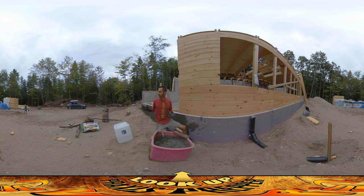What I've done so far is mix it in half-bag batches. For every half bag I'm putting in one decent shovel full of Portland cement — so for a full bag that's two shovel fulls of Portland cement added to the mason mix, just to make it a little stronger.